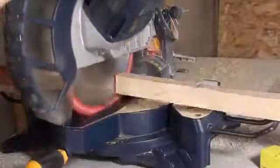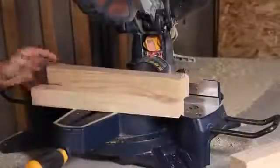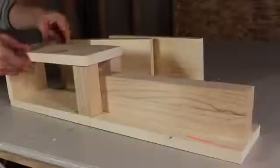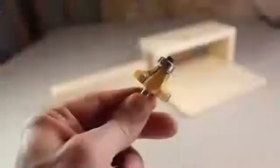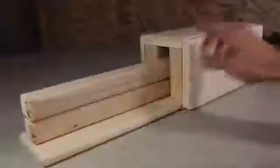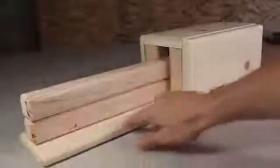Next, I found a 2 by 2 and I'm cutting the nicest parts of the beam into 2 pieces measuring 13½ inches long. Two other pieces are cut at 4 inches, and everything can be placed together to see how it fits — that's the rough idea right there. I'd like to knock down the sharp edges, so I found a ¾-inch rounding bit and routed the appropriate edges to give it a smoother feel.